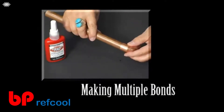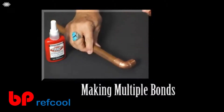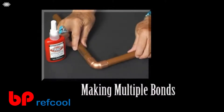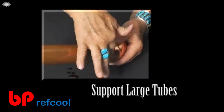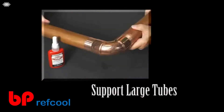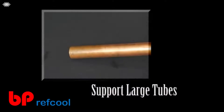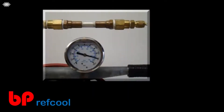It is critical that you do not disturb the bond after the 10-second period and before the three or five minute bonding process is complete. When making multiple bonds on connectors, elbows, or tees, make the bonds one at a time — allow each bond to remain undisturbed for three or five minutes depending on the tube material before making the next bond. When making a bond involving a long length or very large tubing, support the tubing in the final position before making the bond. If the tubing is not supported, the bond will be broken from stress before the mandatory period.